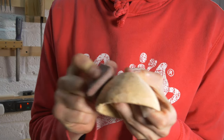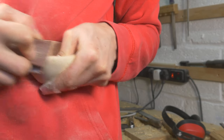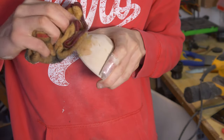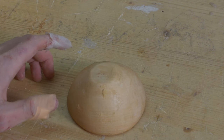You need a nice coarse grit sandpaper, like 60 grit. Now you've sanded your bowl through other grits, I recommend finishing off with something called Abranet. This is 320 grit, but Abranet lasts four times as long as normal sandpaper — and seriously, it does. I haven't bought any spare Abranet yet; I probably bought it around about a year ago. Now you're ready to wax and buff your bowl up.